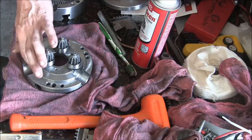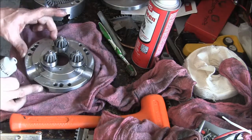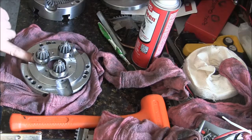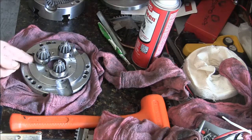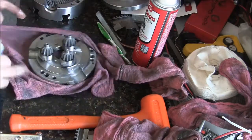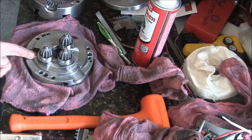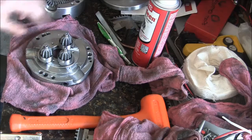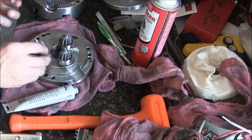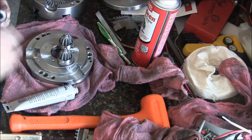Just put back good grease where I took out all the bad stuff. And you know, the front of this thing did have some schmeg on it. There was some moisture ingress going on, which turned that grease milky. So I can only attribute that to the condensation problem that I've had for years until I put the Wino heater in, and hopefully that's the last condensation issue I will have.